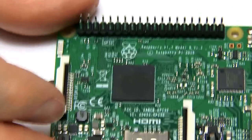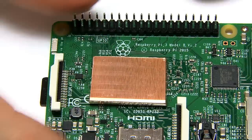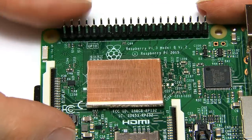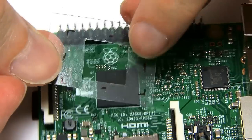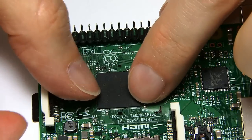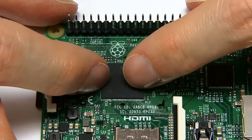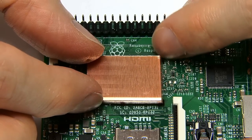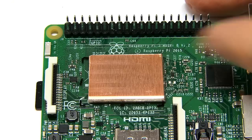So let's bring in the Pi 3. We could just drop this directly on top — there's a nice resounding little click — and it fits beautifully flat. That's why I've got the 3mm copper rather than thinner sheets put together. But I'm going to be extra cautious, so I've made a little piece of plastic with a hole in the middle that fits around the processor. This drops in, nice and loose around the edge, and that means I can be absolutely certain I'm not getting any shorts. The processor will stand proud of that plastic, and the copper will sit free on top.